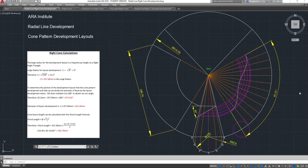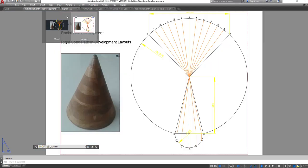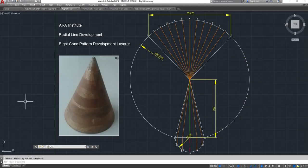This video relates to the right cone and the different types of patterns you can take out of it. I've drawn my basic setup here - it's 125mm diameter on the base, 250mm high to the apex. I've drawn a full profile of the cone developed at the top, then a frustum of the cone in the middle portion, and with the angle coming down at 30 degrees from the side elevation, I've drawn a truncated cone.